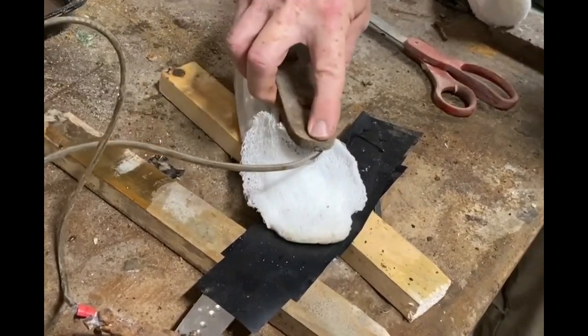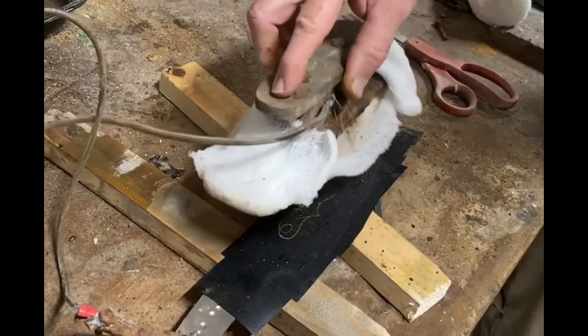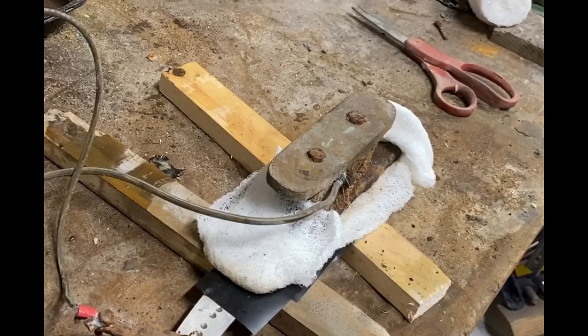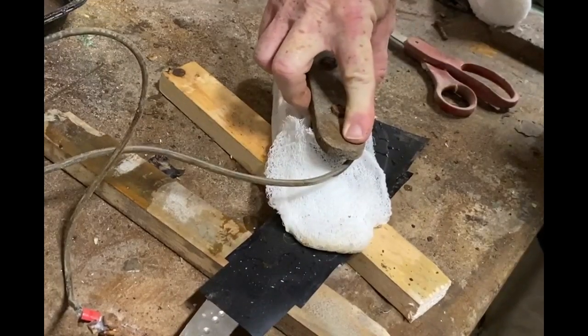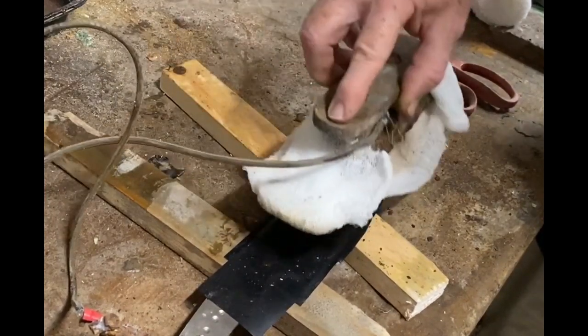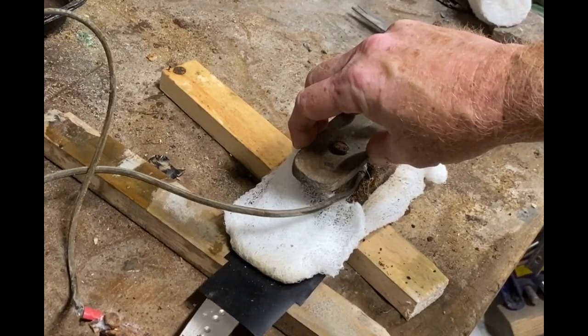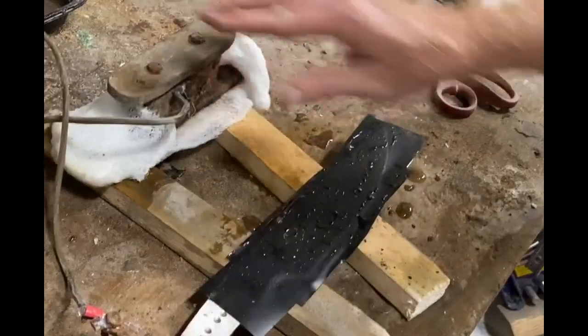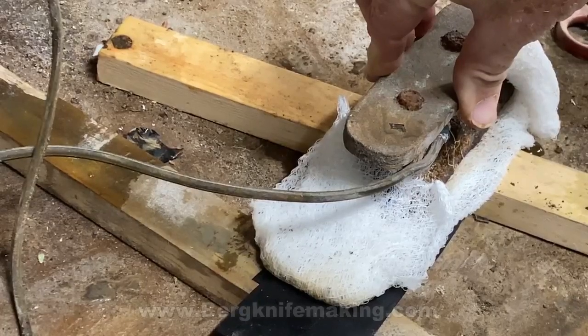I can let it cool by giving it some time, or I can take that blade, disconnect it, and submerge it in a bucket of water. Either way, you don't want that blade to get so hot that the self-adhesive vinyl loses its adhesion, because then you wouldn't end up with nice, clean, crisp etching lines. Also note that I've got it suspended on two pieces of scrap wood so the blade doesn't end up sitting in a puddle of electrolyte solution — all precautions from lessons learned and failures in the past. You want to etch for three to four minutes total at 12 volts, two amps, in 20-second increments at the max, letting it cool a little bit between each, and then really cool down that blade by submerging it in cold water after every minute or so.